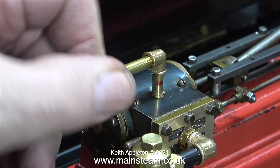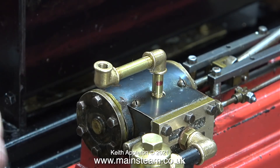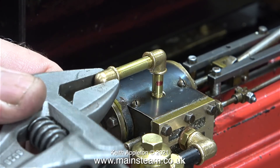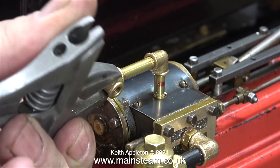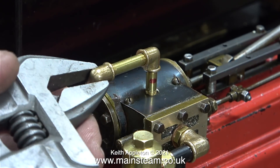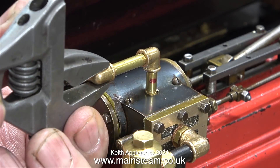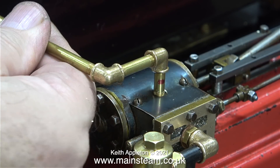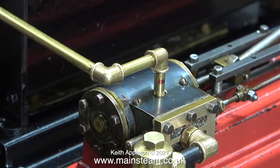Here I'm fitting the second of the cast 90-degree elbows. Generally it's a good idea to screw these elbows onto the end of the pipe all the way down to cover the threads, but on this one, if I did that, it wouldn't be in the right place. My friend Dennis, who's not really a steam enthusiast, assembled the engine and boiler on a board in a position where there's no room at all for an exhaust condenser, so the exhaust pipe will have to go straight up the chimney.